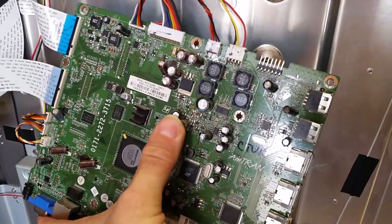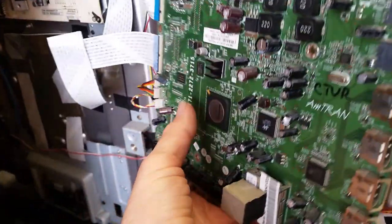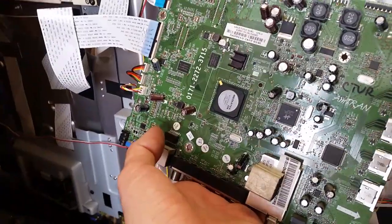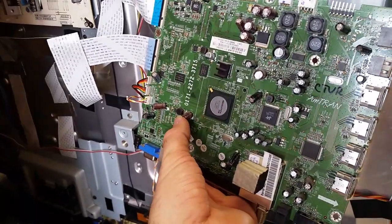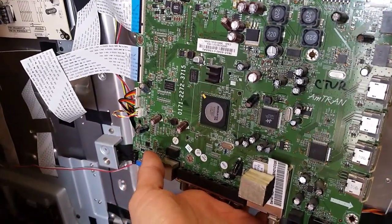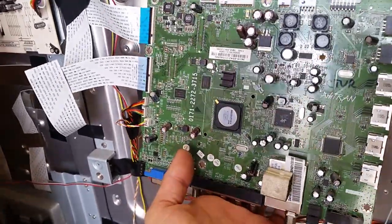This comes up often with all kinds of NAND EEPROMs for all kinds of TVs — the ones that are paged in blocks, as opposed to linear straight classic EEPROM devices. The paged ones are more complicated; they have file structure and different organization depending on bad blocks. It's not a simple matter of copying them.